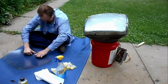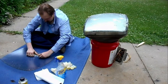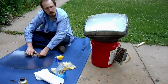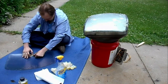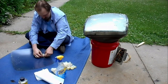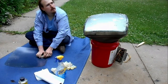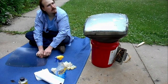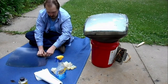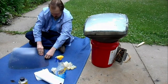In addition to the sun method, there's also using heat lamps and a heat gun. I found RCA cataracts respond best when the tube is evenly heated up in the sun and/or under heat lamps, a long preheat cycle to around 150 degrees where the glue starts to let loose. Once the glue is hot, the delamination can then be coaxed along with wedges and a heat gun.